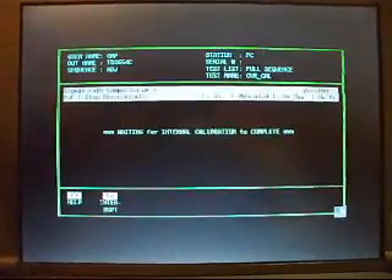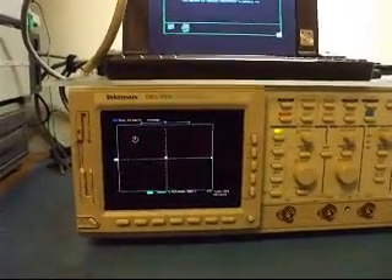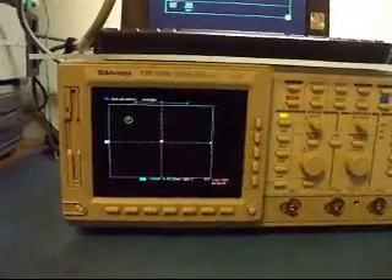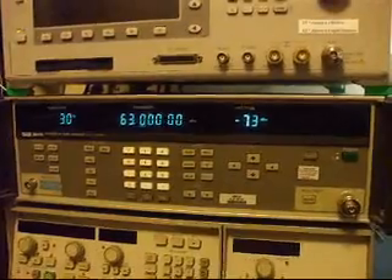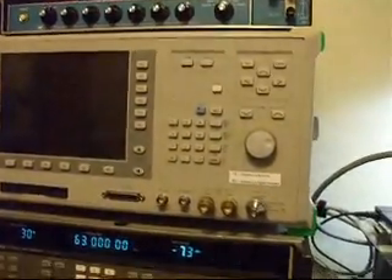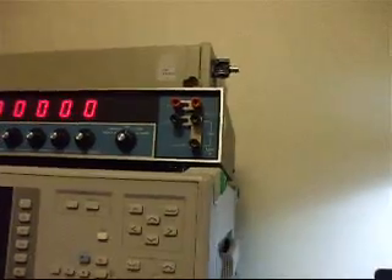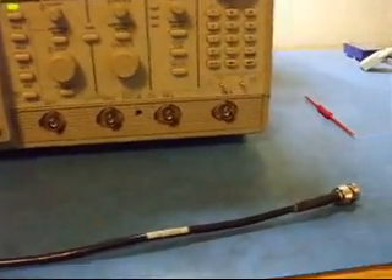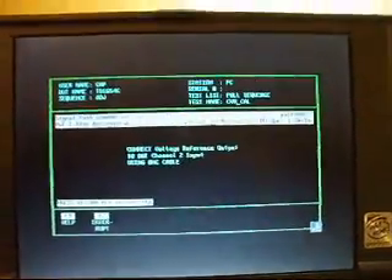Automated system's the way to go, but there's a lot of money in it. It's probably worth going to Tektronix and having them do the calibration. While it's compensating the signal path, it's selected channel 2 because we're going to do the voltage reference calibration first. That channel is waiting for an input signal, although it hasn't asked for it yet. The signal generator has gone to one of the default settings that the software chooses, but it's not going to be doing anything for a while.